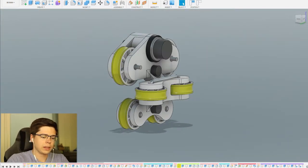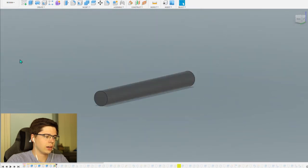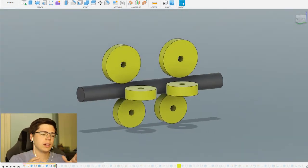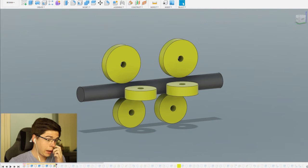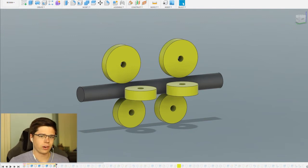I'll start from the beginning. I initially began by designing the wheels themselves — starting with the rail, then designing all six wheels to try and imagine how it's going to look. Rather than start with the frame, I wanted to start with the wheels because that's going to be the actual functional part of this model. I wanted to have that from the start rather than having to work out later that the main frame has the wrong geometry. I would rather have the frame be designed off of where the wheels need to go, rather than the other way around.